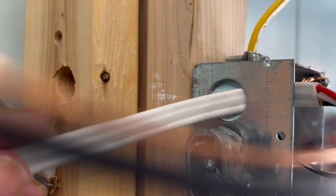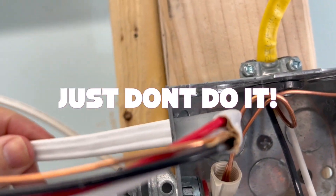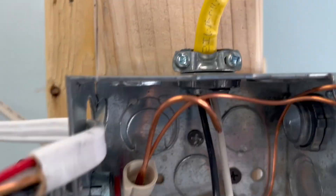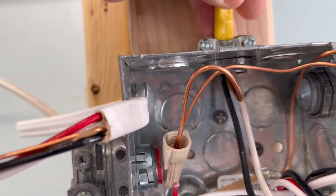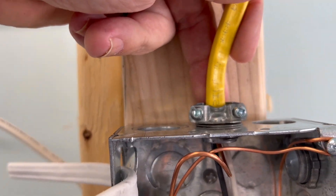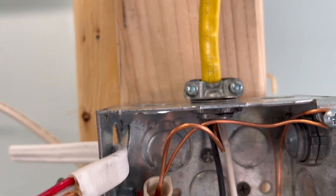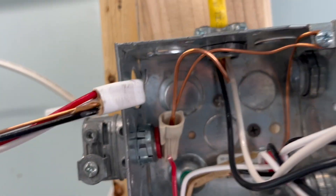Other things people do: no connector at all. They just push it through and think it should be all right — but that's a no-go. The proper connector is this two-screw clamp connector right here. You can put one to two wires in this connector. A lot of people complain they're only made for one, but you'd have a thousand of these in a panel and good luck finding all the knockouts if you put just one wire in each one. So you can put more than one in there.